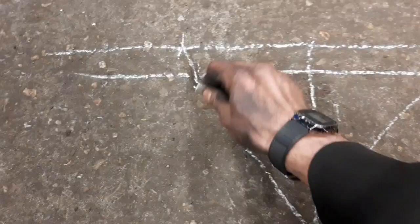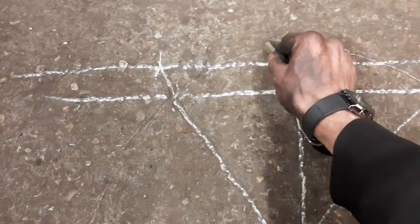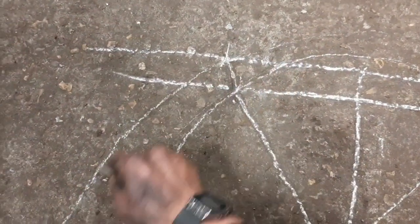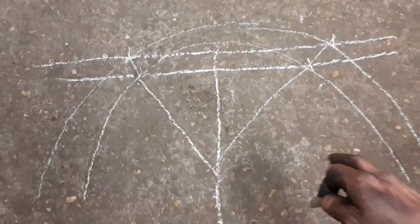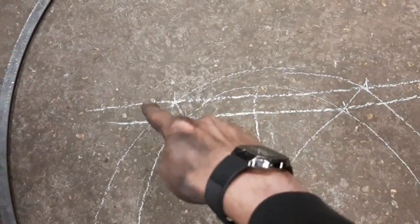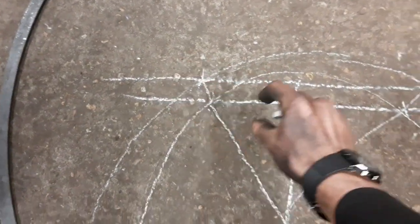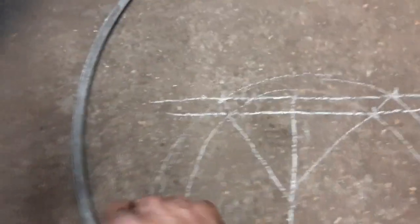And then you'd get a pair of compasses and you'd strike, first of all, an arc here, starting from, you know, compasses set there and there, doing that, and then again the same thing here. Now that's horrible drawing, I know, but in theory this arc here is meant to be the same width as this, and those two lines up here, the space of them apart is the width of the bar we're using. So this is 25 mil, so for the sake of argument that's 25 mil apart there. So the radius that you get would also be 25 mil, and that radius there is the radius that you pre-bend the bar to.